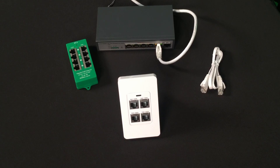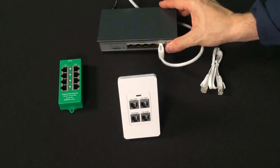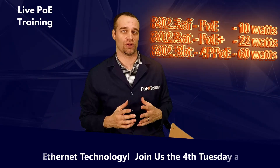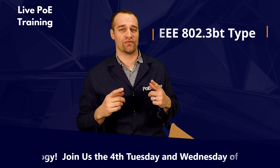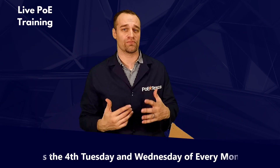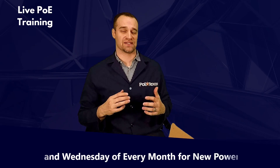The GBT4IW works with any type of PoE, from traditional 802.3AF PoE and PoE Plus all the way up to the new high-powered PoE. The type of PoE you have will determine what power budget you have available on your GBT4IW. To get the most out of your GBT4IW, you can take advantage of the new IEEE 802.3BT Type 4 PoE to get up to 60 watts of PoE power on this device.